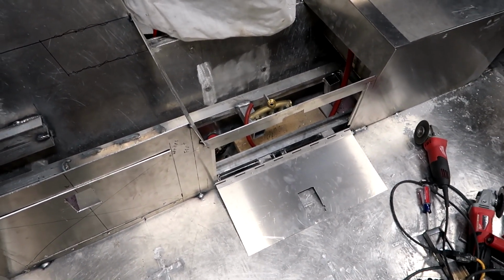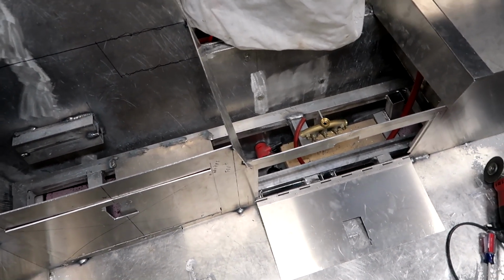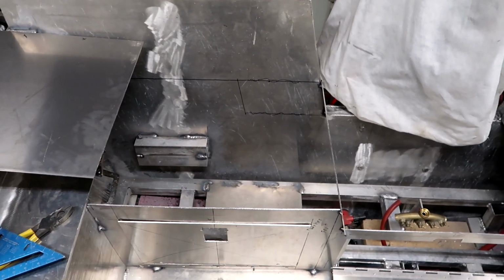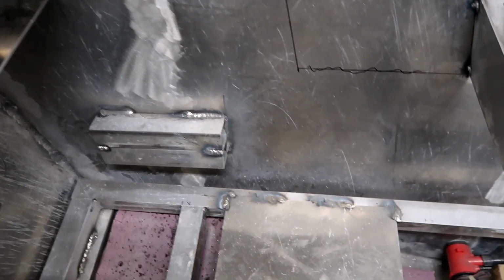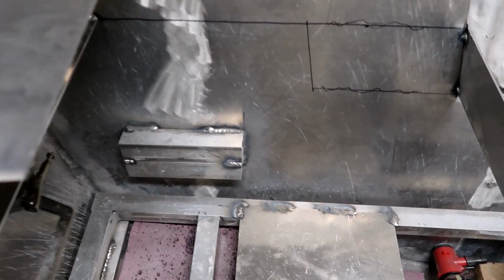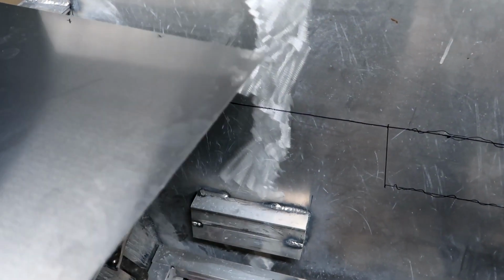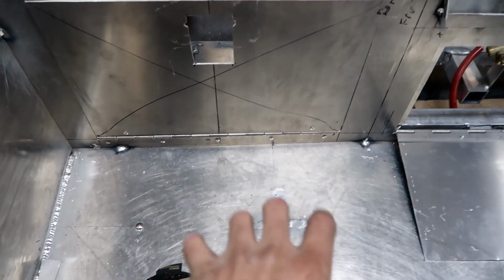I think it's a pretty good idea, as opposed to having 3 separate live well pumps. So anyway, what I've got here is where the pumps are going to be mounted. So they need to be kept in the dry and out of a lot of vibration and stuff. So I've got this plate cut right here, and that's going to get set on top of there and welded in. And so that's going to give me a nice big flat place in the back to set stuff, because my driving seat's going to be right here.